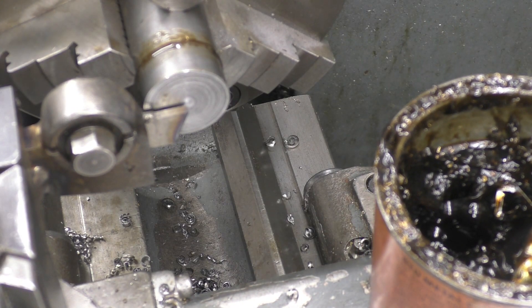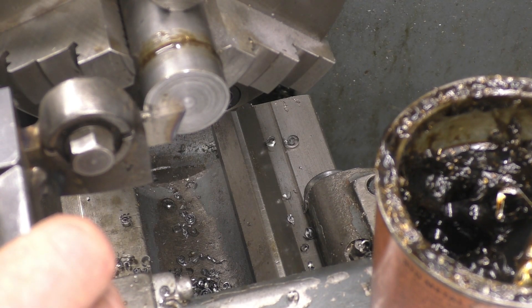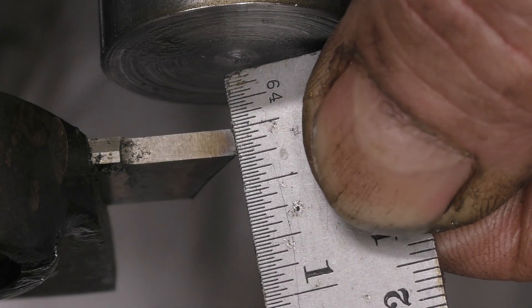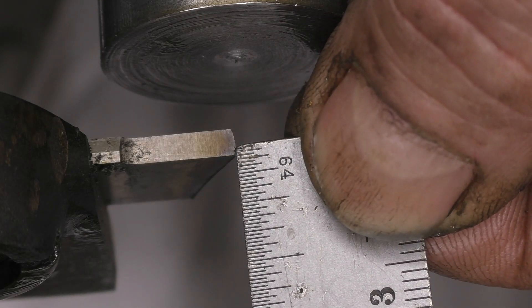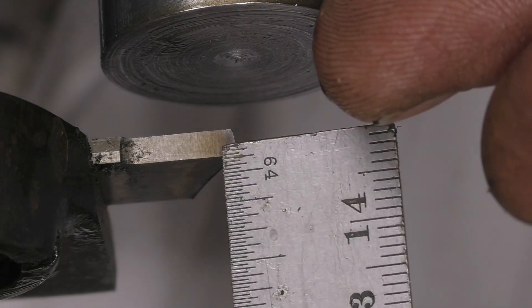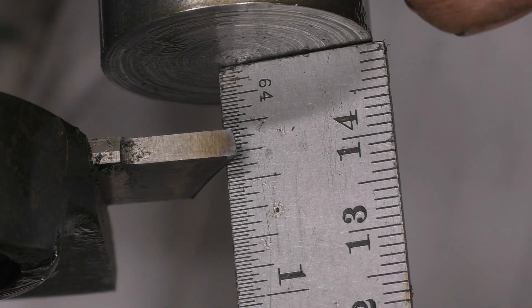With this type of blade you can loosen off the tool post and set it so it's touching to get 90 degrees. Notice the end of the blade has been ground at an angle — it's got a few degrees of taper. It's going to cut on this corner of the tool first, which means when you break through, the pip — if there is one — will be left on the piece of stock, not the parted-off piece.